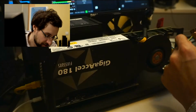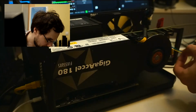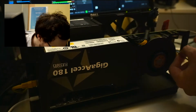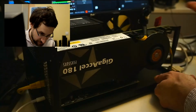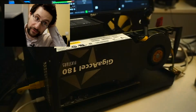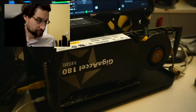So yeah, I quickly soldered that thing here with some regular DIY 2.54 millimeter pins, serial console there. It's like transmit, ground, receive or something. And if I just screw off the handle here, this full-length snap-in workstation thing, then I can even close this, and it might take maybe 10 or so dB away, but yeah. Anyway, that's it for today.